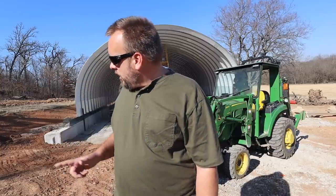The first test I want to try is digging in — not to dig a hole, but just to grade off the top layer of dirt over here where I've already been working. This soil is a little bit softer, not hard-packed. The ground we're going to try to actually dig into is hard-packed over time. I'm going to see if we can just peel the top layer off with a level bucket. We'll start each test with the factory bucket, then switch to the Piranha style, and see how much difference it makes.